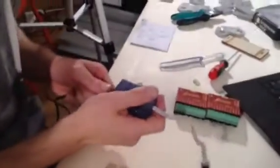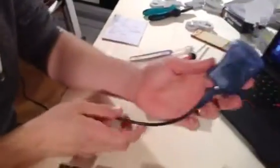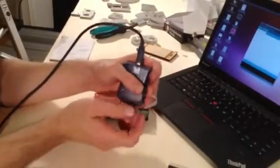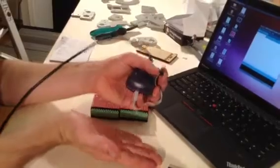So the hardware required is, what is that? So this is a standard programmer. It's an AVR programmer, and it allows you to write firmware to a chip that doesn't have a bootloader. It's standard USB on one end, connected to the computer, and the other end is square USB. Okay, and I actually need one more thing. I need an Arduino to do this.